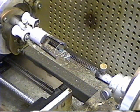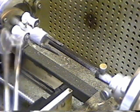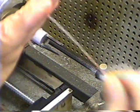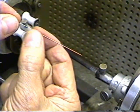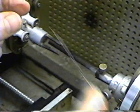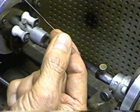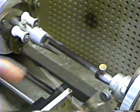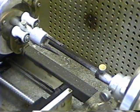The next thing we have to do is make the seal that goes through the side of the tube. This is our pinch. For this one, we're going to be going through the envelope, so we're going to put a bead of glass — we'll seal the bead of glass onto the tungsten, and then pull that bead up to a hole in the envelope and seal the envelope onto that bead of glass. That way we don't have to try to make the seal while making the connection to the envelope — we would never be able to do that; it would break and melt and turn into a mess. So we have to do it with a bead.